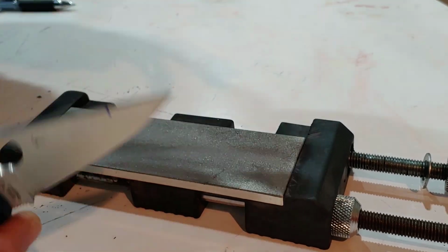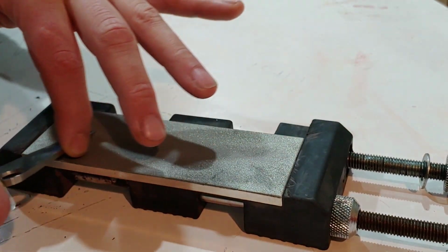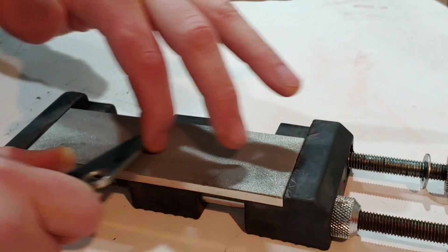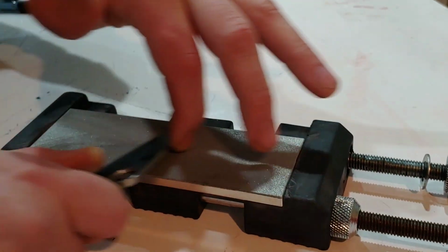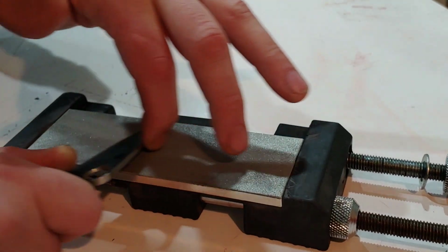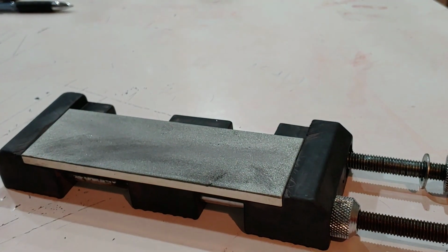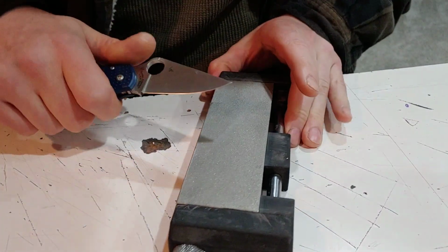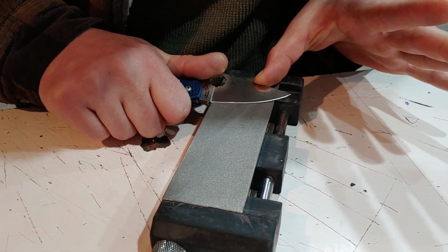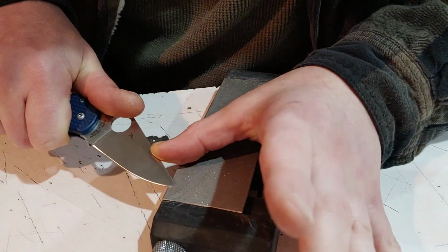Now I'm feeling for the burr, and I can tell that spot still hasn't been hit yet. So a few more passes. And however long it takes, it's going to take. You just do it until that edge bevel is completely covered in grit and you have a burr on the other side. Okay, now I have gotten a burr on the other side, so I am flipping it over, doing the same thing. Holding my angle right there, I just cut the burr off,